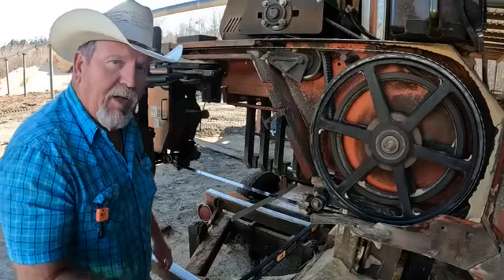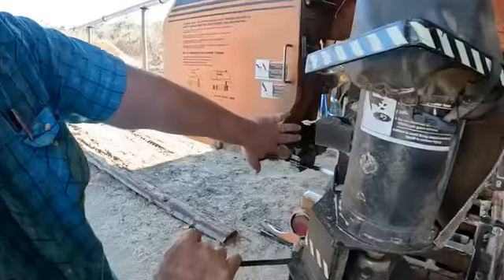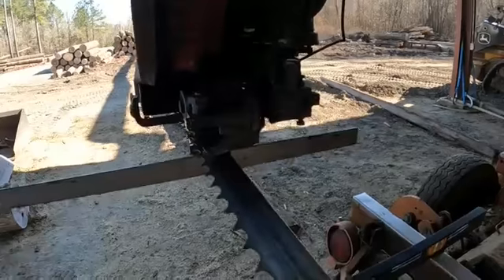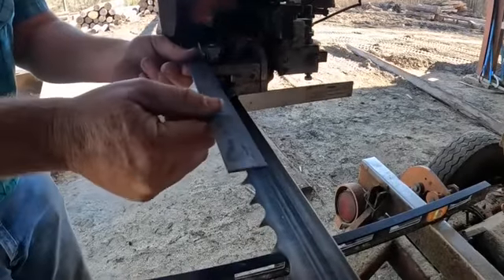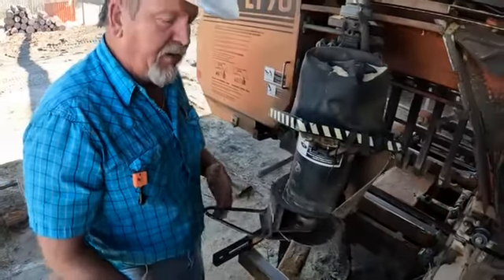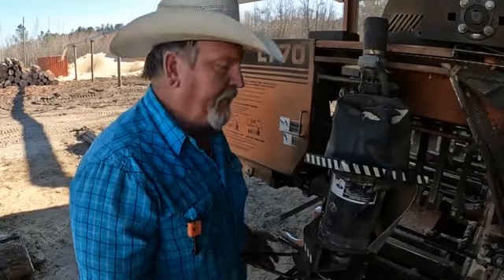Inside your pulleys — your blade wheels, band wheels, whatever you want to call them — Wood Mizer sells what I think is a B73 belt for the LT70 25-inch band wheel. I run a B72. I run the B72 because of the amount of dry pine I cut. You will end up with sawdust building up underneath that belt, and it will get between the belt and the pulley causing a hammer action on that blade, which will start breaking blades regularly. I've had it break the bolts holding things together. When you're getting enough vibration to break bolts and blades, it's some form of operator error.